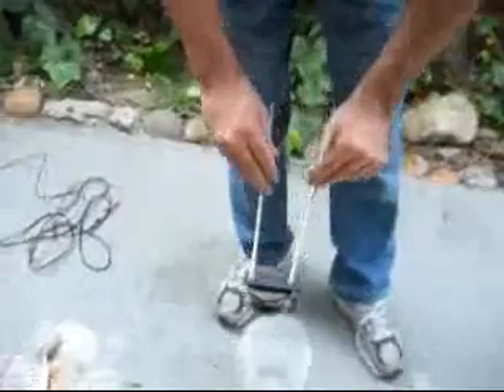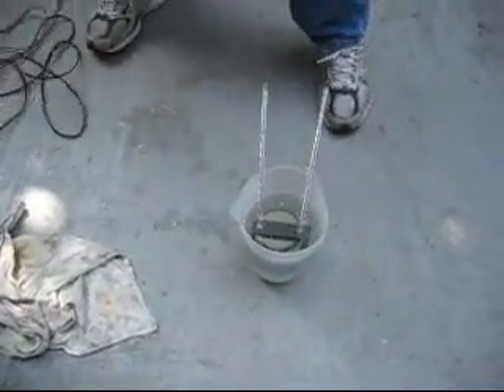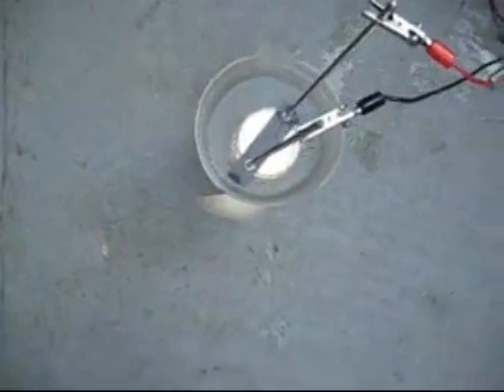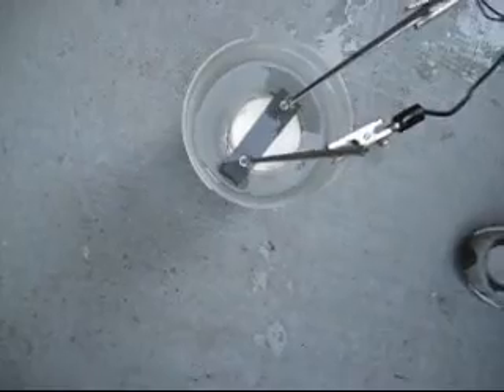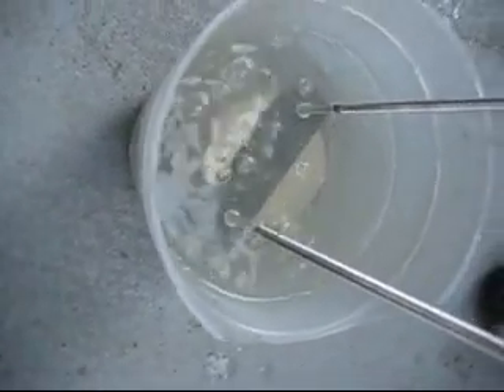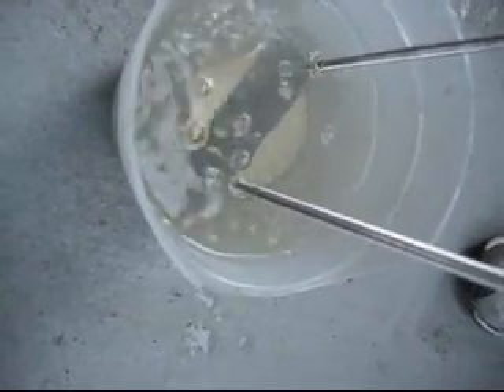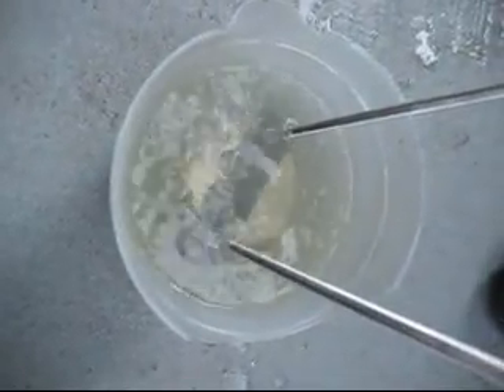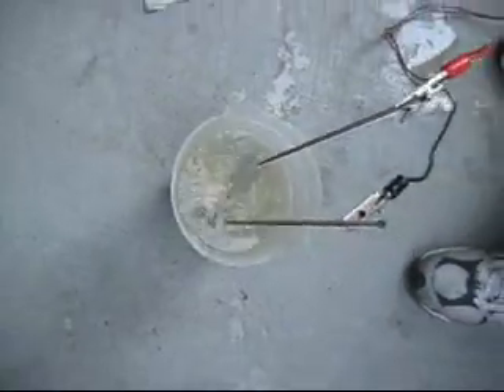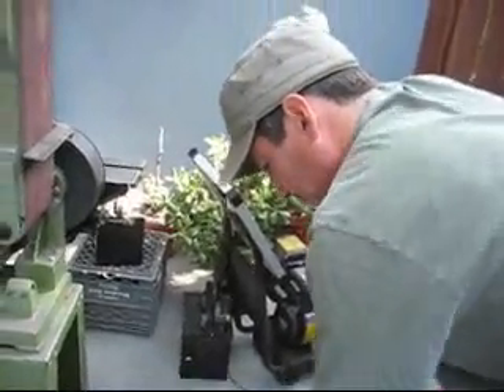Let's get on to business. How many square inches did we say? 150 square inches originally. And with 21 plates, we have 280 square inches — so this is a little bit more surface area. The plates are so close together they actually hold oxygen and water. Turning it on now, straight to a battery — no electronics. There we go. That's just 21 plates. We could easily fill that tube with 50 or 75, and still have room for a water level gauge. But it is working straight off the battery and producing pretty well.